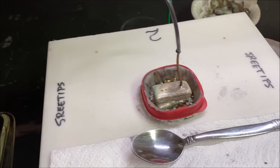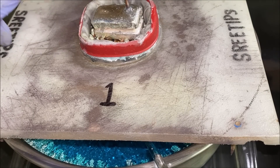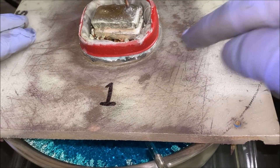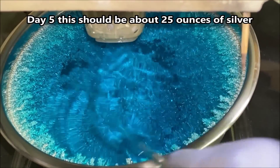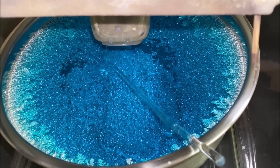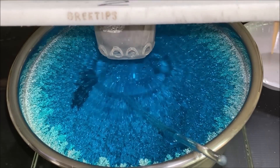On cell one and cell two, I'm not going to add any more impure silver. We're going to let this go ahead and react through the cell, and then when I get down to a certain level I'll make up a new filter and change it out, because the current flow is down when the filter gets full of slimes. Here's what silver cell number one is looking like — beautiful, just absolutely breathtaking color of blue. Same with cell number two. We'll let this silver get consumed and then make up a new anode filter basket, which will increase the conductivity through the cell and speed things up.